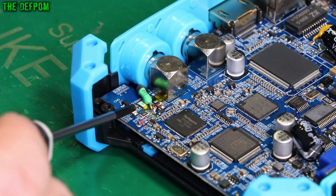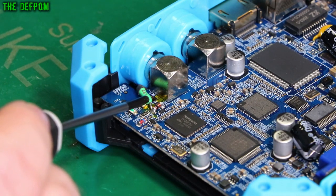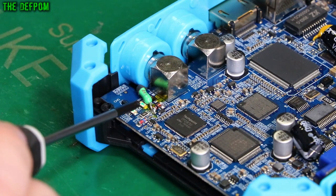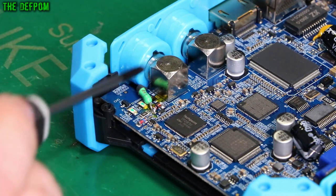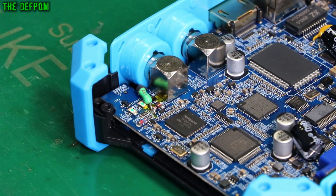So it's been working fine ever since. I did this bodge — it's a temporary repair — and that's worked fine. So I'm going to keep this fusible — well, it's actually a fuse, I think it's like a 1A fuse. I'm going to leave that there, that can stay right there as it is. I'm not going to change that circuit — that's replacing that track that runs around to the back of the board onto the center pin at the BNC. What I do need to do is change this diode to be a TVS diode again.